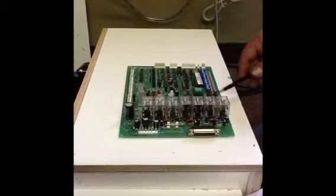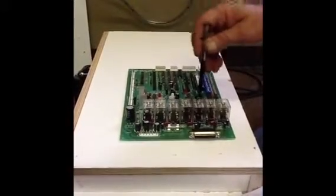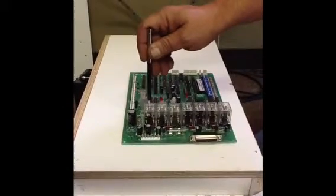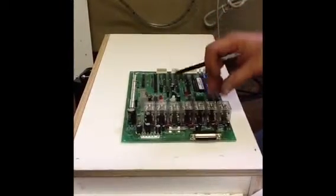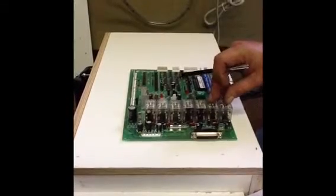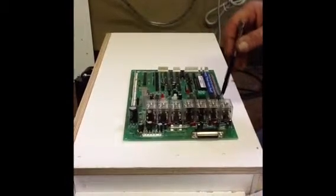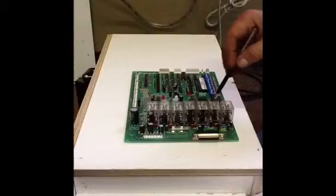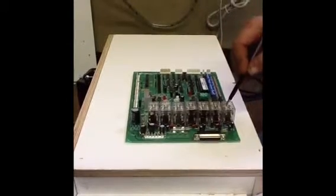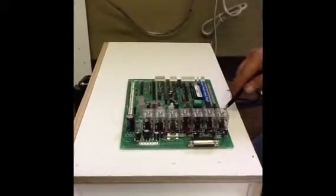These are the seven relays. Number one is at the opposite end of the big capacitor, so you've got relays one through seven. Number seven is for your claw to close — that's the only thing it does. The first two relays handle front-to-back movement: one is forward, two is back. In order to come back to the front, it uses relay one to make relay two operate, so if one is bad, two will never work. That's how they work together. One is on the edge of the board; seven is down by the capacitor.